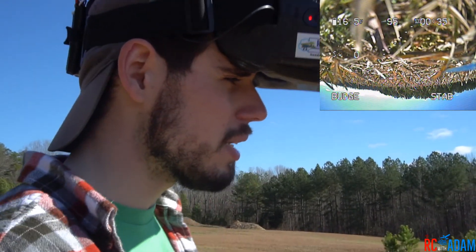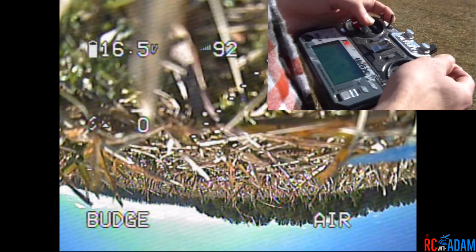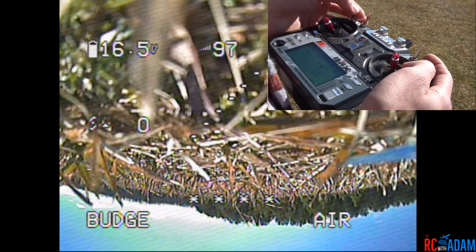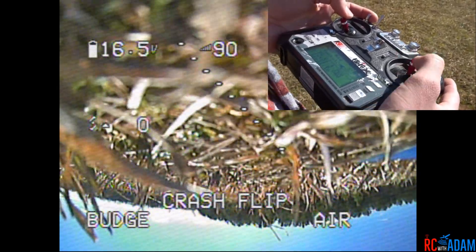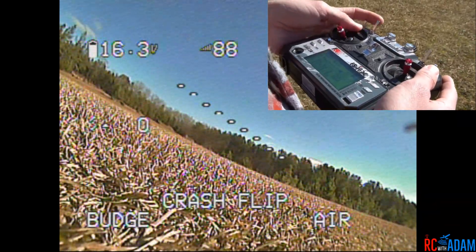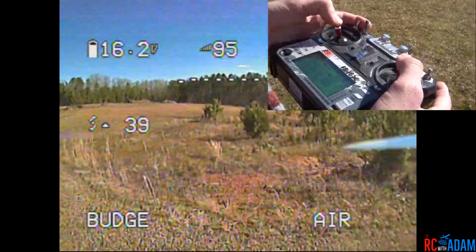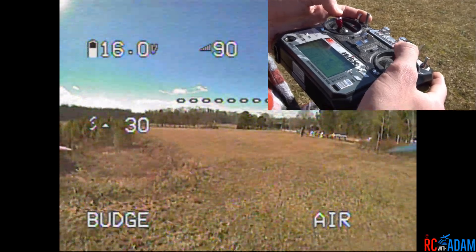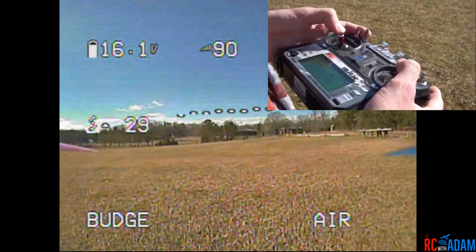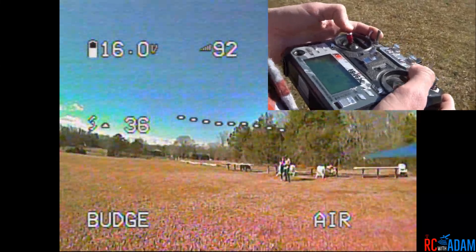I put the quadcopter upside down as though we were flying and then kind of crashed and fell upside down. In the goggles, say we're in air mode — I'm pretty sure this will work in air mode as well as regular acro. I'm going to turn on the crash flip recovery, then I hit Arm and you see it says 'crash flip.' I'm not sure which way I'd want to go but you can go pretty much any way, and it will basically just power up that motor. You want to be sure to turn it off — I think you have to disarm — and then here we are flying around like nothing ever happened. I don't really recommend using this all the time because if you can't see your quad and check it after a crash, you don't know what state it's in. But if you get into a situation where it's on top of a building or someplace you just can't get to, you may really need to use this — so it's a nice thing to have, but not super necessary.